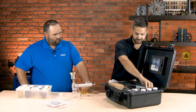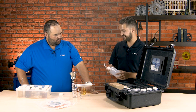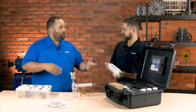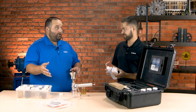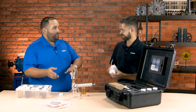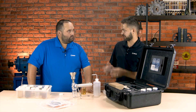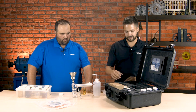They provided this solvent dispensing container to allow you to properly put the solvent in the funnel itself. But you also need one of these filter devices that you use, because if the solvent is contaminated, that's going to show up on your patch and you won't know if it came from the solvent or the machine. So running it through a filter, you're basically removing the chance for a false positive or disrupting your data. It's really important to make sure that things you're seeing in that patch are truly coming from the machine and representing the sample. This is one of the fundamental aspects of oil analysis.